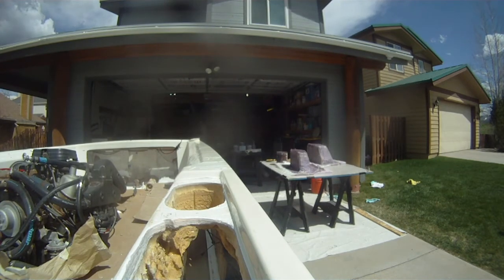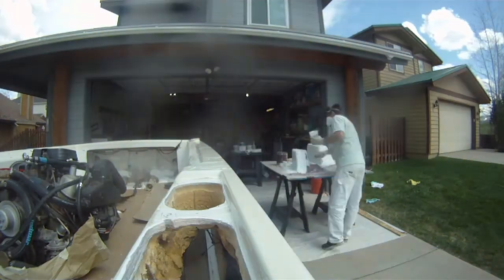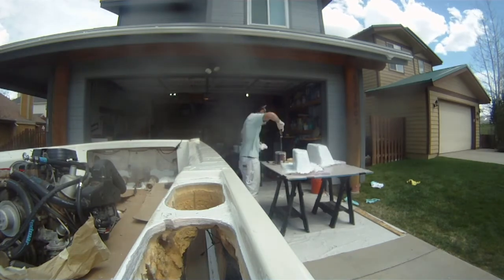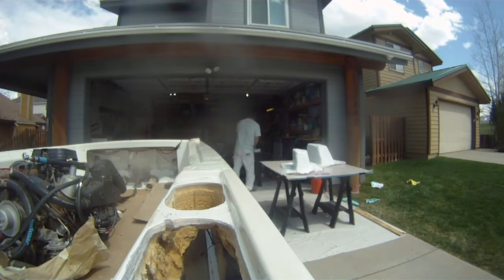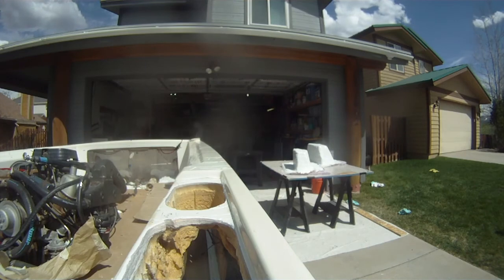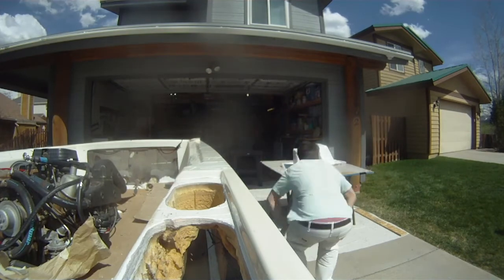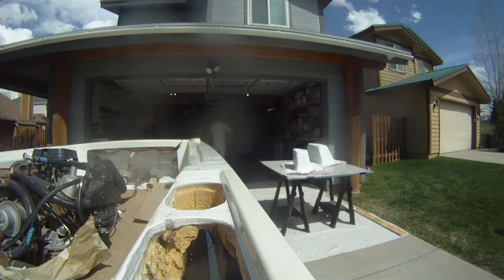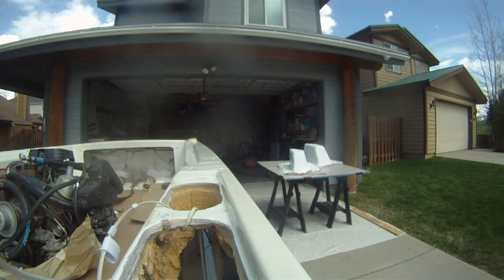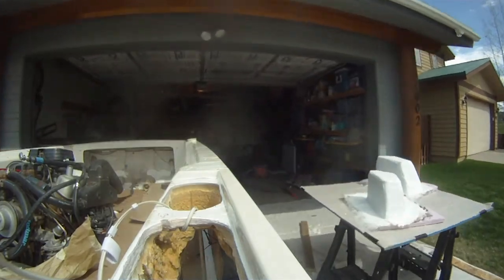After a lot of effort and a lot of peanut butter, I felt like I had these things close enough. I wanted to get gel coat on them and I was also running up on the end of the day — I needed to go pick the boys up. So I mixed up some gel coat and gel coated over them. I'm thinking I'm going to be able to sand through that peanut butter still at this point. Clean the brushes, clean the equipment, get everything out of the way. The wind is just blowing the rags around but I think I got them all. At this point I'm thinking: if I can sand them I can still make this happen. Tomorrow I will build the molds on top. Hopefully they release. Cut a hole in the top of the boat — boom — in-dash cooler. Coolest feature on the boat, totally awesome. Is it going to work out like that? You'll have to watch tomorrow's day of working.